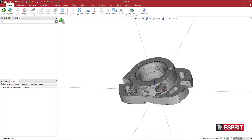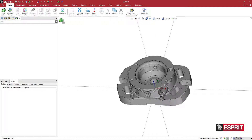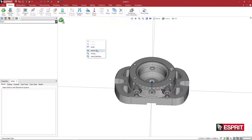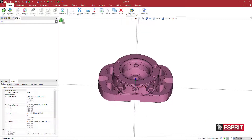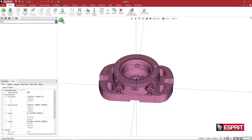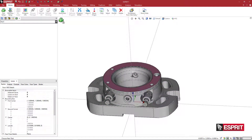Now the X-axis is pointed sideways. Most machines have the X-axis going side to side from the machine operator. With these connections I'm just going to leave it as is, but you can rotate the model by right-clicking, selecting all, copying, and picking rotate with a move and angle. I'm going to leave it as oriented now. What we want to do is make the location for the next fixture component, which is going to be at the center of this face here — so the work plane just needs to shift upward to here.